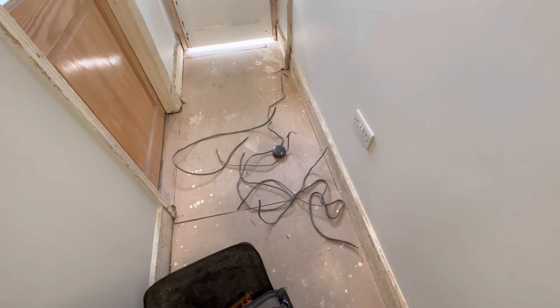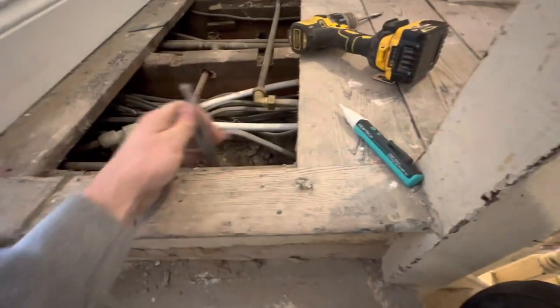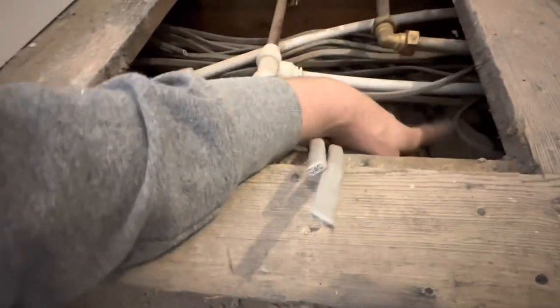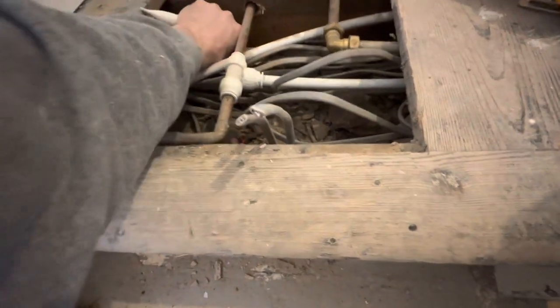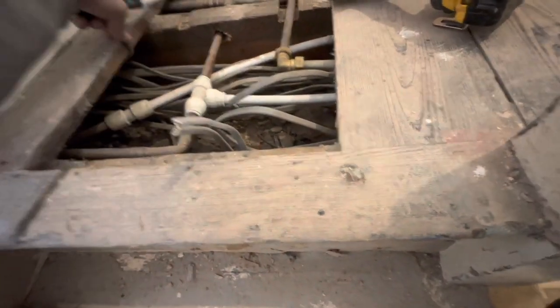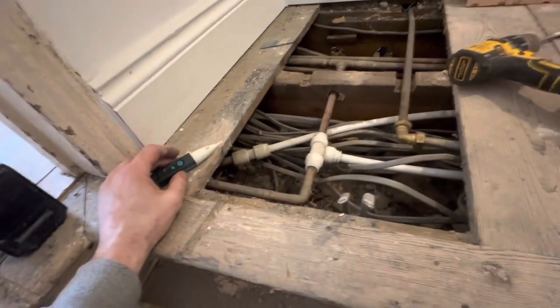That there is random cable that was just left under the floor — strangely already cut but just shoved under there. These are going to be the two new legs for the ring that I'm going to be running in. I've managed to find the kitchen ring. This is one leg of the kitchen ring and this is the second leg of the kitchen ring. I've tested those — let's test them again. As you can see there's an abundance of cable there. Some of that cable is live, some of it's not. These big old ones — that one is live, that one there is clearly not live. But it's showing live because I haven't separated it well enough, and obviously these testers are not the best but they do a job when needed.